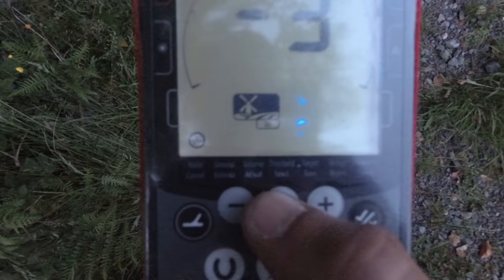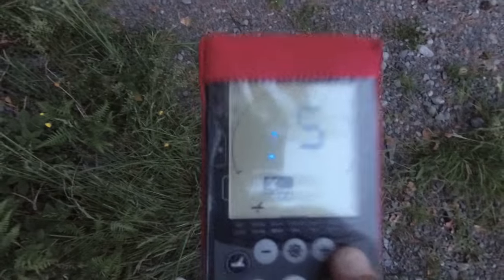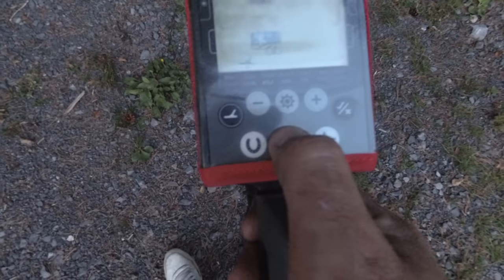After you've done noise cancellation, the next thing you're going to want to do is a ground balance. If you go here, press the settings button, go to ground balance — you'll see it's flashing there. Next, press the accept button, hold it down, and bob. As you do that, you can see I'm on something very metal here. Probably not the best example — let's go across a bit. See, it's starting to settle back up now. This is why you use the pinpoint at the start to get a nice bit of clear ground. That's going to settle on about 24 because that's what the ground is. Once you've done that, again, press the accept button.